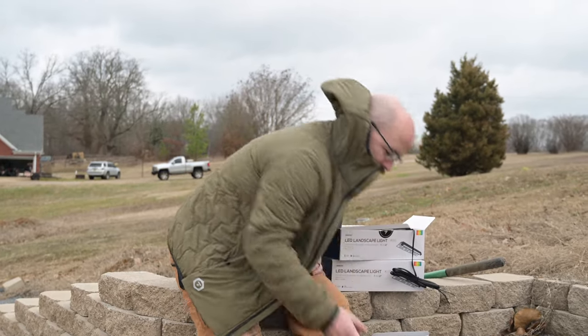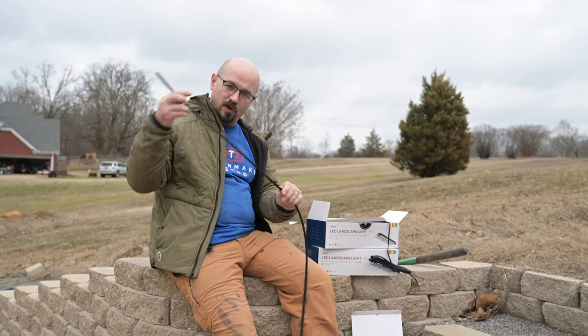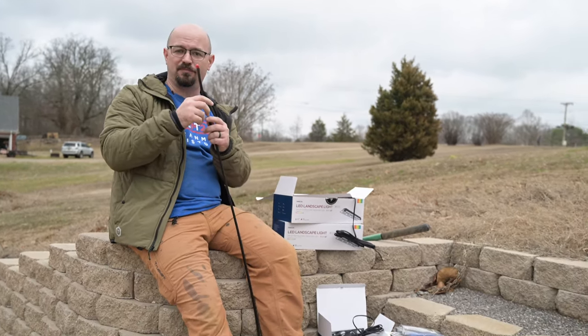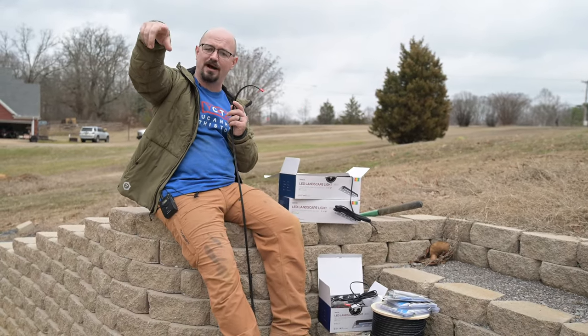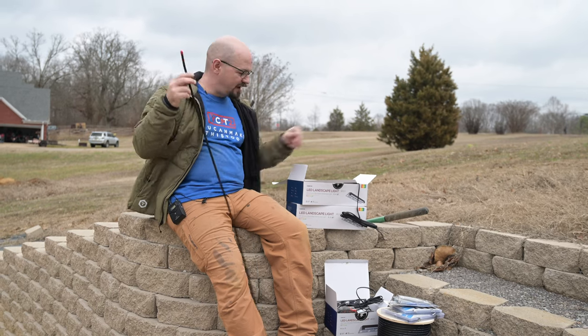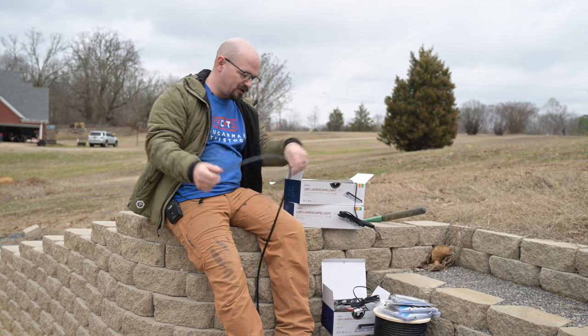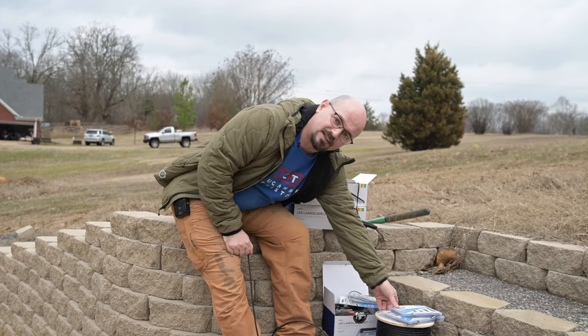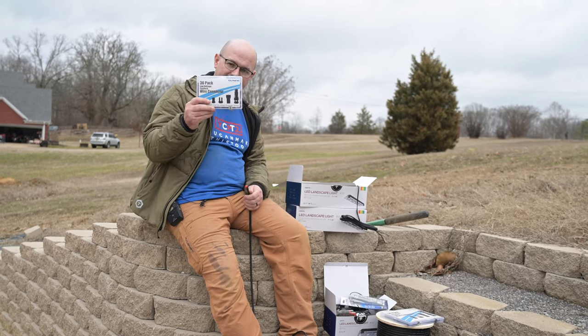So the basic concept here is I have this spool of 12 gauge wire that's gonna be my backbone. So this is gonna run the whole length all the way back to where the pool house is gonna be and the transformer. And then all my lights are just going to tee into this. The way I'm going to achieve that easily and quickly and with least chance of corrosion is by using wire